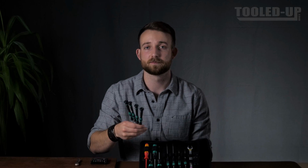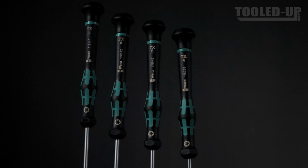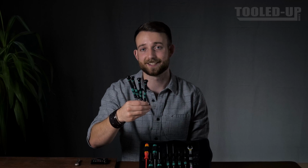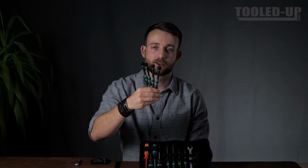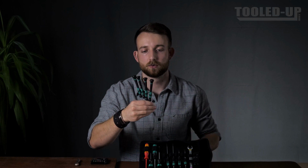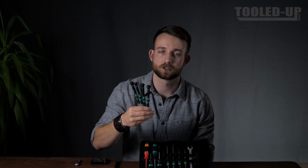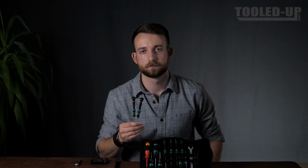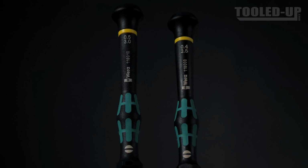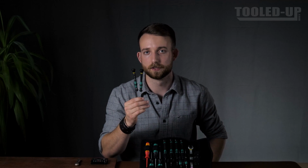Next up are the included microsetter screwdrivers, four of which are Torx, ranging from size TX4, 5, 6 and 8. This is denoted by the colour coding of green around the end. The micro screwdrivers also have a swivel tip to allow for fine motor control whilst applying constant pressure. Two more of the micro screwdrivers are slotted in size 2.5 and 3. These are denoted by the yellow banding at the end of the screwdriver.